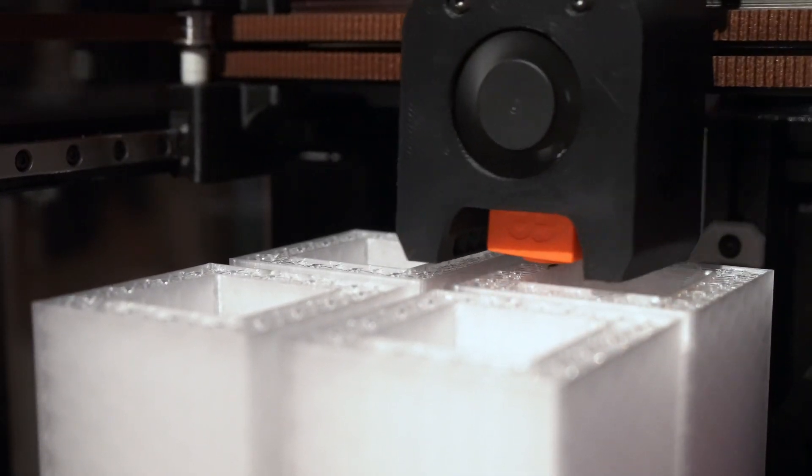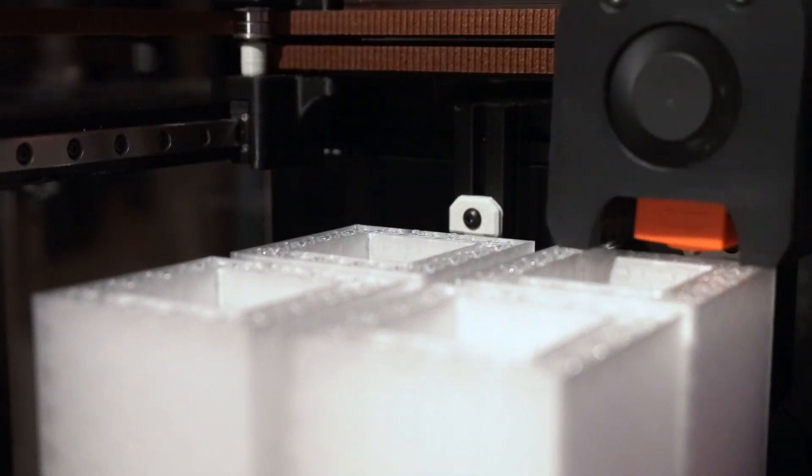I did have quite a struggle to print the PETG perfectly, but those are just some slicer settings that needed to be optimized, and the filament of course needs to be properly dried. I also found that my Voron 0.1 is really great at printing these risers — it just happens that four of them fit perfectly on the build plate and basically fill the entire volume, and it is very quick and super precise at printing. I love my Prusa, don't get me wrong, and it creates beautiful prints, but there are quite a few artifacts on many of the prints on my Prusa, whereas on the Voron it just comes out a lot more smooth. On most regular PLA prints you cannot see these differences because the color directly absorbs it. But if you're working with something that is slightly transparent and you're working with light that illuminates it, any sort of tiny mistake just immediately gets amplified and becomes very visible.